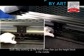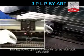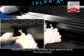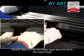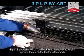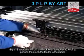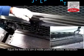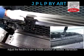Step 6: Work up the front sinker, then put the height block in the middle. Step 7: Push the new feeder bases above the block, then adjust the height. Step 8: Push the front and back knitting needles to knitting position, then push the feeder to the middle. Adjust the feeders to aim at the middle position of the needles intersection.